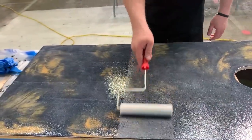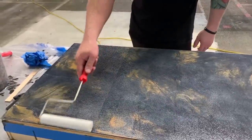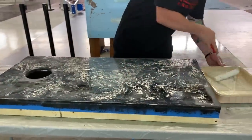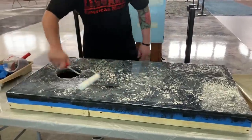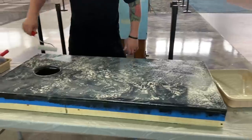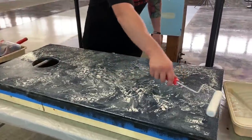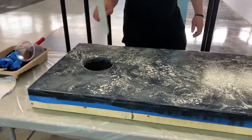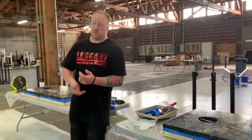I sanded pretty hard on these edges with 220 grit, so because of how hard I sanded I may need to do two coats of the urethane — we'll have to see. Right now I'm pushing really hard; the roller's not even rolling. I'm just making sure I've got a nice liberal coat on everything. It's pretty fit now. Then I'll roll it sideways, let up on the roller so it can start evening that out. All right, we'll look at those tomorrow and see if we need to do another coat.